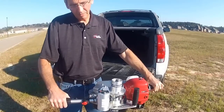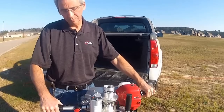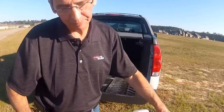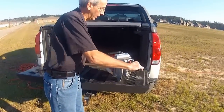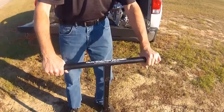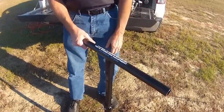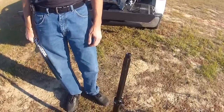17, 18 — start the throttle back. There's my 20 turns. It's a good idea after you get the valve fully open again to simply put your valve T-handle back on, your valve wrench T-handle. Give it probably about a quarter of a turn. It's going to make the next guy's job a lot easier when he goes to operate the valve.